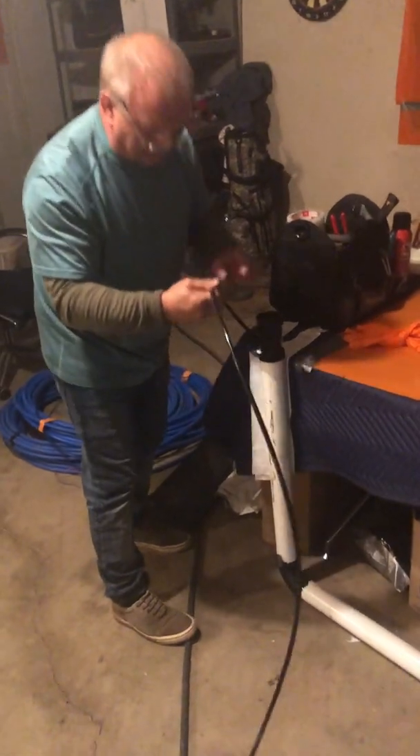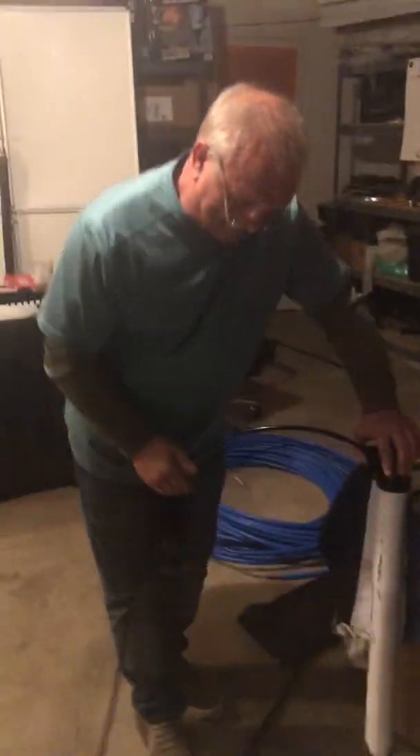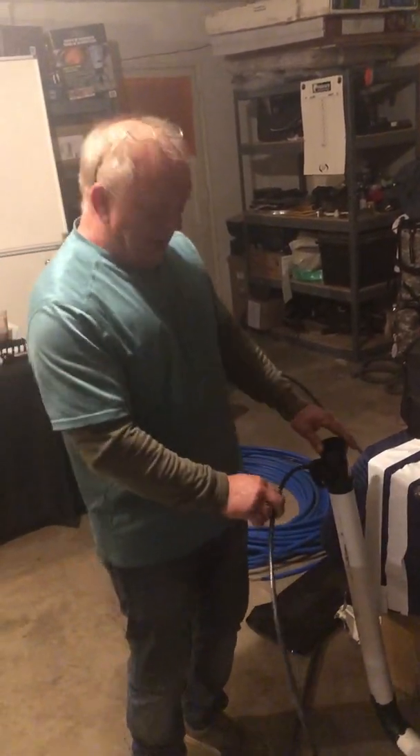Basically, push it down — you've gone around the bottom bend and we're now coming around the 90. We're coming through the cut-out section, and this is essentially where we're going to line up our repair. Normally we'd have this cable marked so we'd know exactly where it is. You can follow it down with a camera, get everything in place, and now you know you're in position.